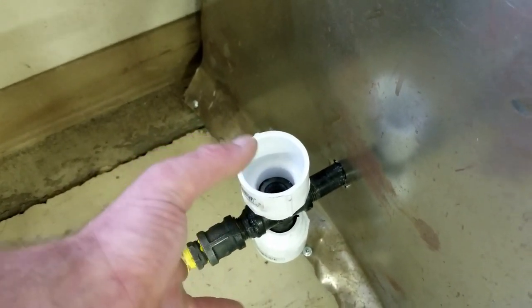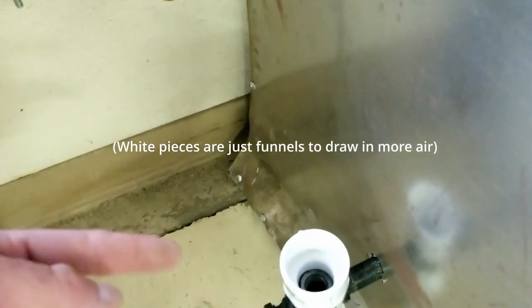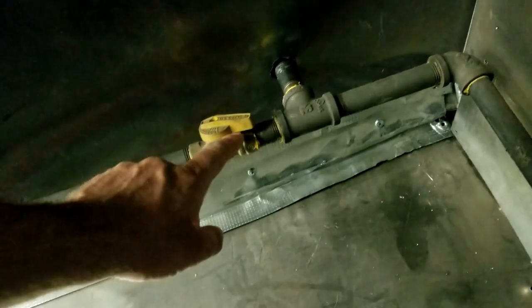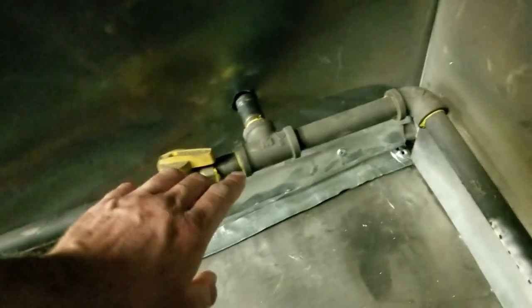The air is forced in on both sides with the gas as it goes through, which mixes the fuel to the air and gives us a nice fuel-air mixture. It comes through the wall and splits. I have a normal little ball valve right here, which I have kind of choked off, so less gas comes to the shorter pipe and more of it is forced all the way around to the other side. I've always expected this thing to melt, but I've been running it for a bunch of years and it's still working just fine. In between each of the fittings I have high-temperature Teflon tape rated to about 1,200 degrees, and each of the joints are wrapped with that. It works really good.